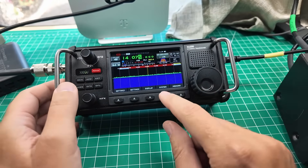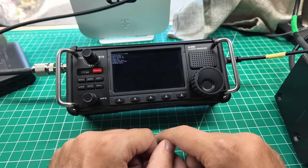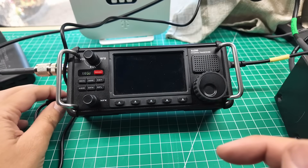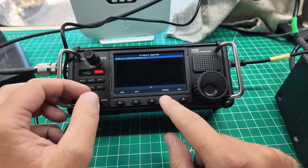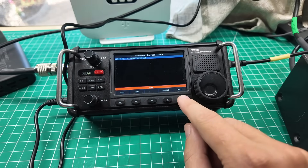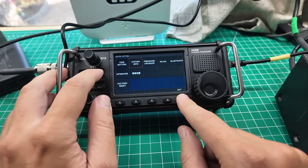So we'll just do this real quick. First, I want to go into system — this is version 103, September 24th, 2024, and I'm going to put 106 on it. Power off, power on. It says update finished. I'm going to pop out the SD card while it powers itself off. We've got our shore power plugged in, we're booting back up again. System, firmware upgrade, upgrade. It has internally rebooted itself. System info says 106, January 11th, 2025 and January 14th, 2025. So we're in good nick there. I'm going to go ahead and reboot this thing anyway, just to be safe.